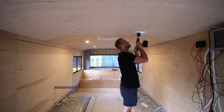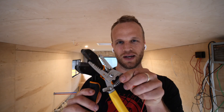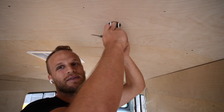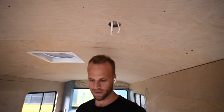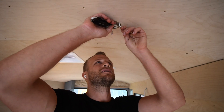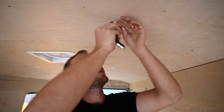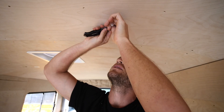Before I put in these last lights, let me show you what I'm actually doing. Tools I'm using: a box cutter, wire crimpers with three sizes, and wire strippers. We are splicing a light into a series right here. Take a knife and take off this sheathing - don't cut too hard or you could cut through the wire. Once you've done that it'll just slide off, then do the other side.